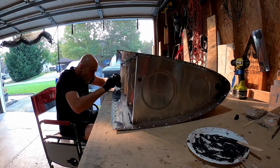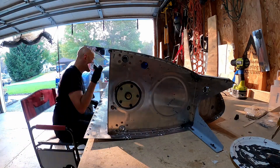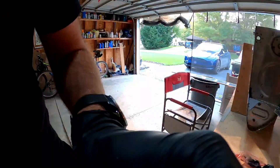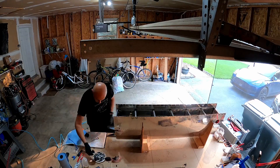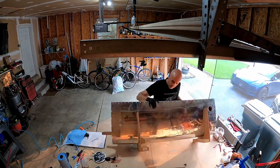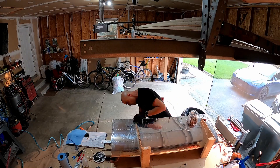I love piping. It was actually a lot of fun piping it onto the tank like that. Make sure it's in there. The bead should be about the size of an AN3 bolt shank, and it should be just in front of the rivet line.